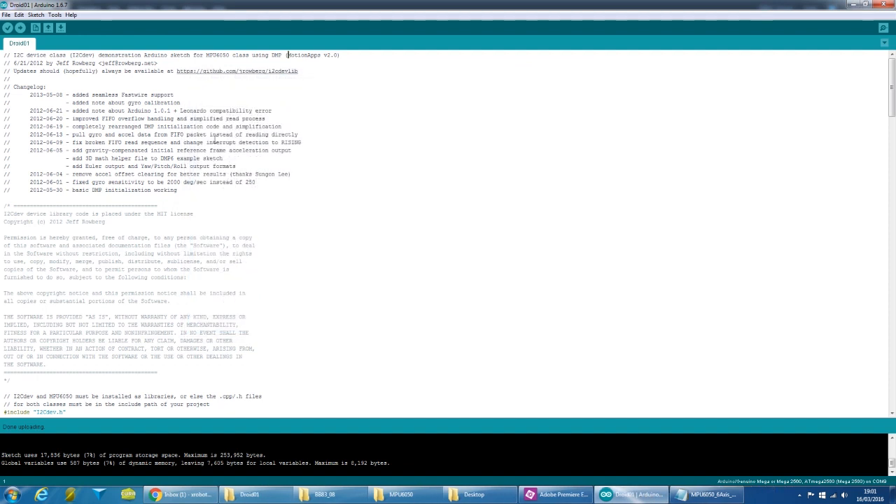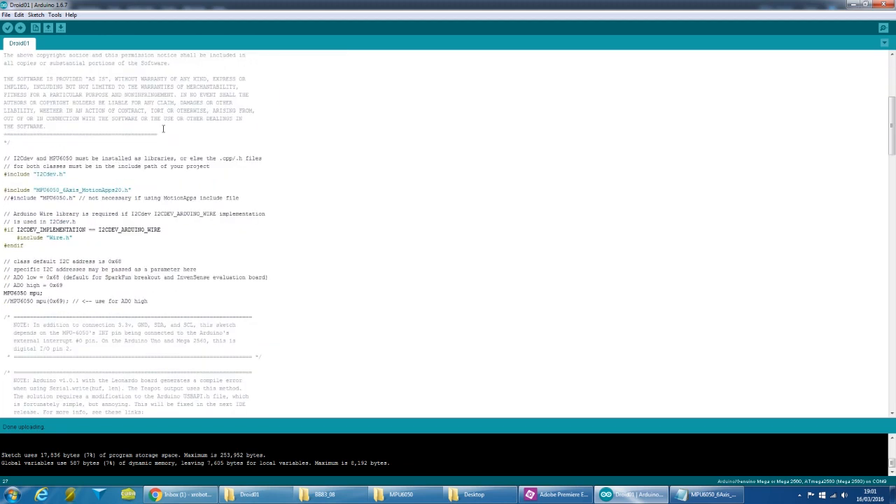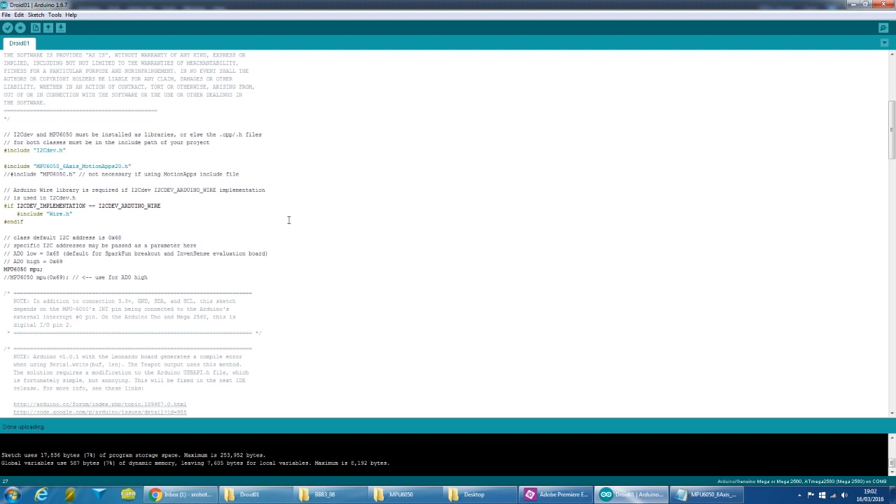As I said in the last part, this is part of I2CDevLib, which is open source. This is the MPU6050 class using DMP, the Motion Apps version 2. Credit to Jeff Rowberg who wrote this — released under the MIT license, which basically says you can do anything with it as long as you keep the copyright notice intact. Effectively what this does is cause the board to do onboard processing to combine the accelerometer and gyro, much like the BNO055 I did last time but without the magnetometer. This is currently maintained and recently updated. I've edited it down — I've just got the real-world angles out in degrees for this sensor.